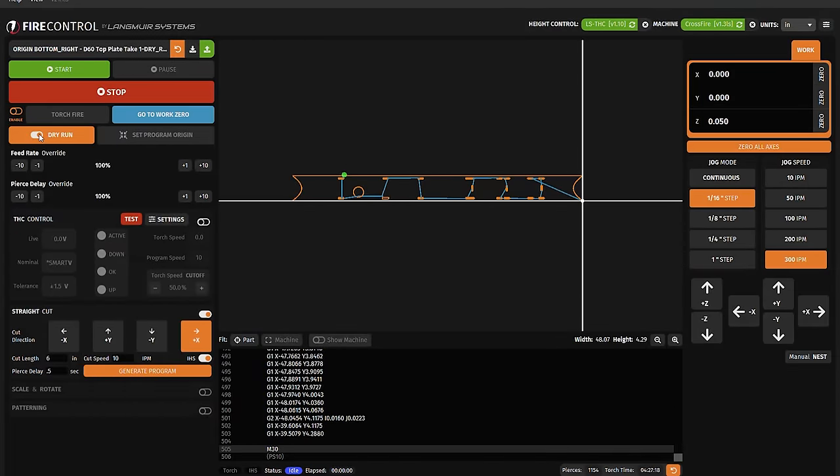We now have control arm mounts. I ran out of welding gas as soon as I tacked on that last bracket. I started with the upper control arm mount — it's pretty simple, just three pieces. Instead of designing it with circles like I usually do, this one I did a diamond and then some triangles on the side, just for aesthetics. The third piece that connects the two outer pieces I recessed into the bracket — I saw a couple of other guys doing that online and thought it looked really nice. It's three and a half inches tall so the Johnny joint doesn't interfere with the truss. The passenger and driver's side lower brackets use the same four pieces of metal, although on the driver's side the inside piece had to bend outward instead of inward to fit on that three to three-and-a-half-inch section of tube. There's also going to be a top plate tying into the truss for those lowers, and a piece of metal on each that ties into the tube.